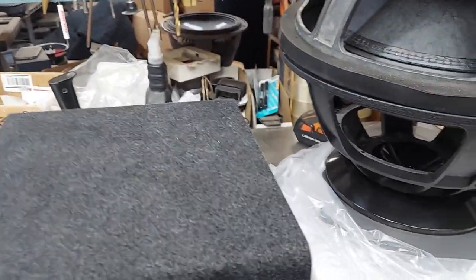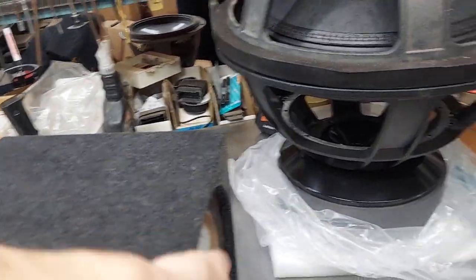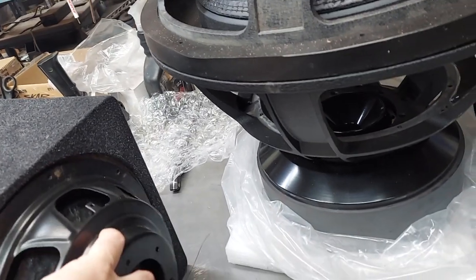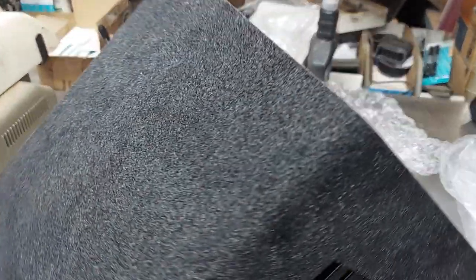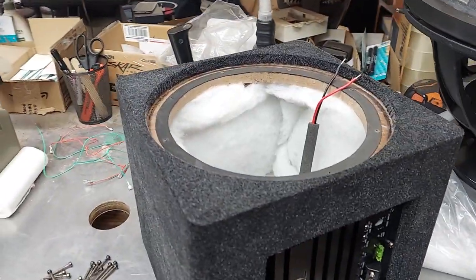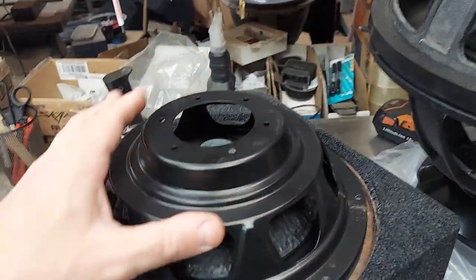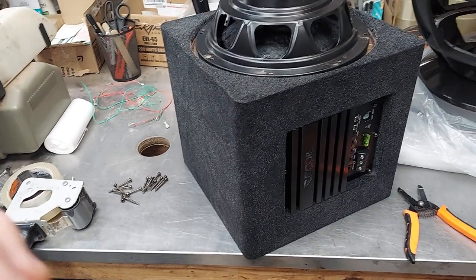When tuning a passive, you put the woofer in where it's supposed to go, and then the passive radiator — this floppy one here. I like to mount it with the back side out, because that's the side I'm going to add mass to. You can't put it face down without hitting the table, so if it has a grill, use it, or put little feet on it. You only need about four screws; it doesn't need to be super tight.